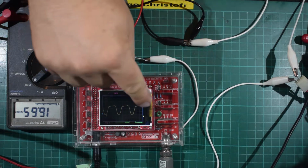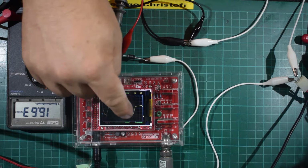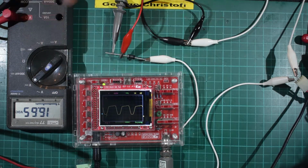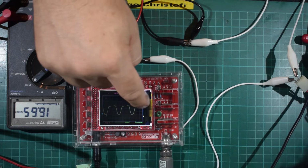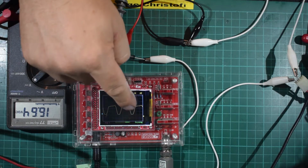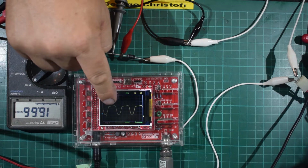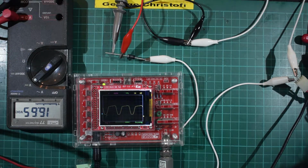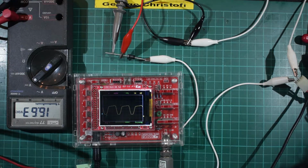And there we go. We've lost pretty much all of the negative side of this waveform. So now, instead of seeing 3 complete cycles, we're seeing 3 half cycles. We're going from 0 up, back to 0, and then staying at 0 until we go up and back and up and back, and that's half cycles. And each of these peaks is still 1 every 50th of a second, or 50 hertz, 50 cycles per second, but you're only getting half of it.